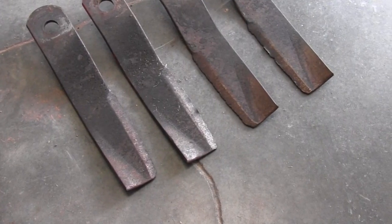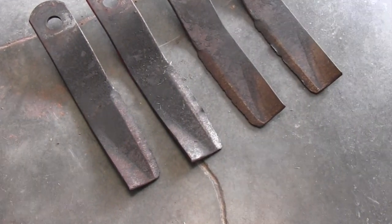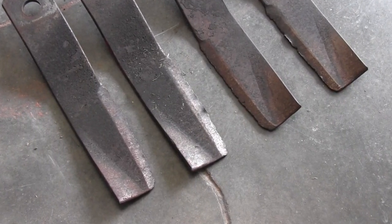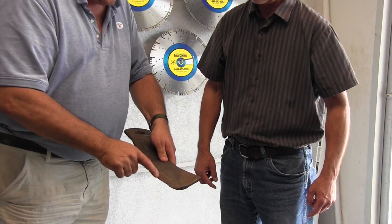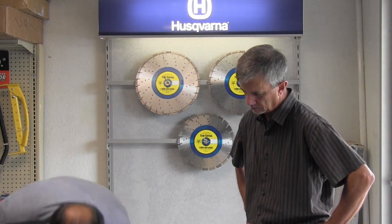I tore the skirt off but I'm still running the same blades. The takeaway is there are a couple of blades that look like they've been sharpened more. If you're going to sharpen your blades, make sure you sharpen equally on both sides — if one side is sharpened more than the other, you get wobbling and damage. If you've got a big ding — ping pong ball or marble sized — you can take a grinder to it, but you're heat treating that blade.